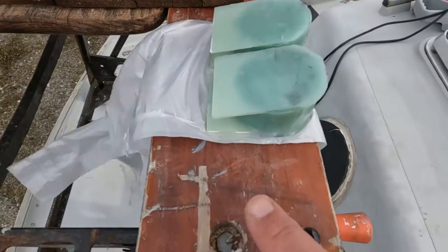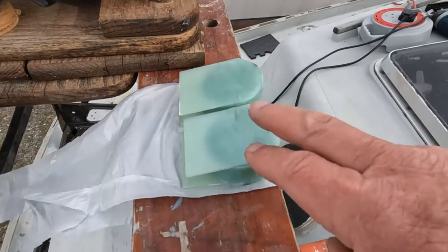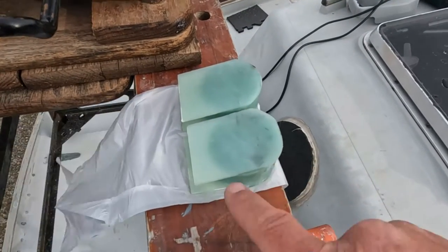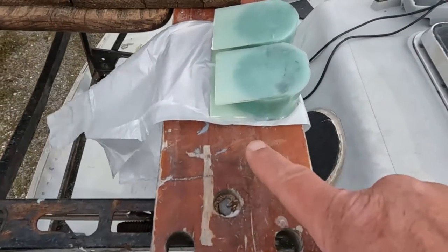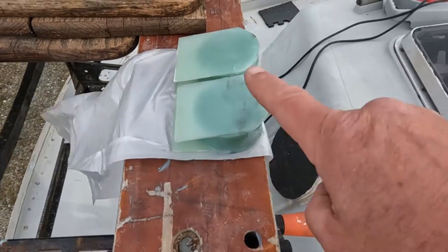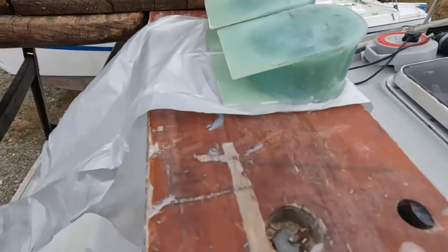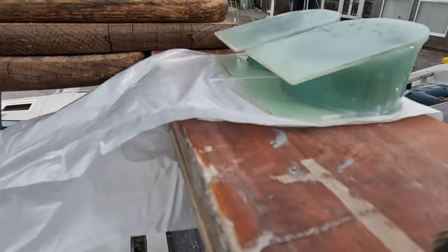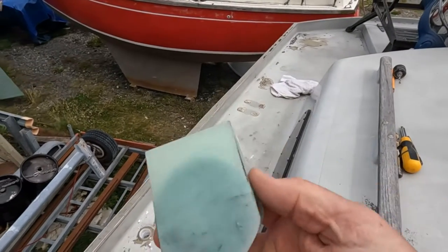These are the revised version of the mast tangs. Still undecided as to whether long term I'm going to use FR4 or not, but as I've got the materials I've made these two. I don't want to move it because it hasn't fully set, but you can see that's the end plate on the sloping side — so that'll be the side against the mast — and then this one will be the retainer, with just a small enough gap between them for the shroud loop to go through.